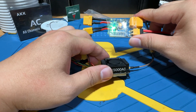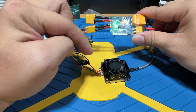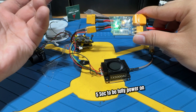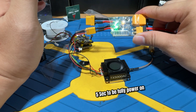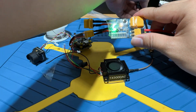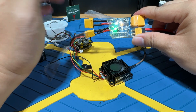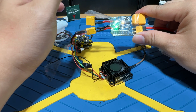Based on the TX5000 manual, this unit requires about five seconds to fully power on to its maximum 5 watts. You're not going to get full power immediately. Currently it may not be set to max power, so we'll need to go into Betaflight to verify the setup is correct.